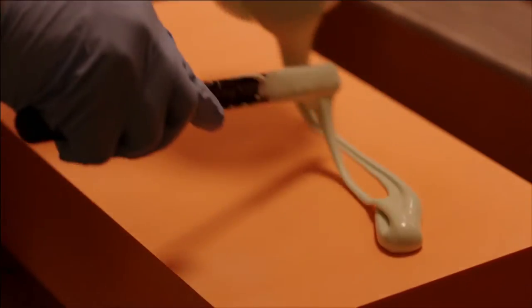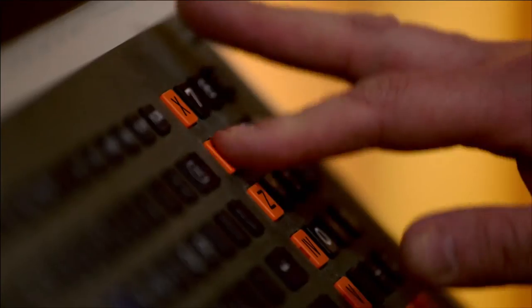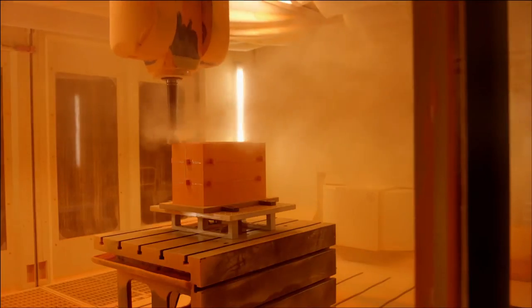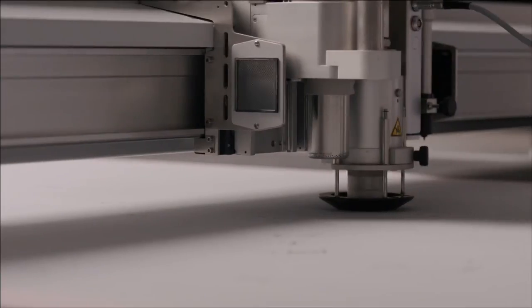Composite bodywork is quite a complex and labour intensive process, but it's a process we're prepared to go to to make bodywork for the people. It starts off life in the technical office where the designers prepare designs and choose the shape of the bodywork they want. We have to manufacture patterns that we do on some of our larger machines here, and the patterns create almost a form, a shape — a copy of the shape that we want. And then we take that into our clean room where we lay up the layers of carbon fibre cloth.